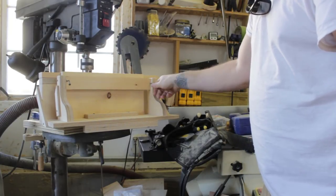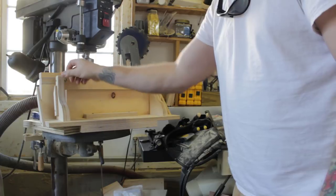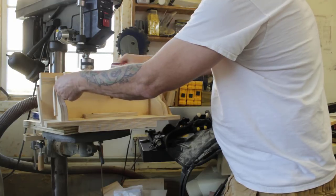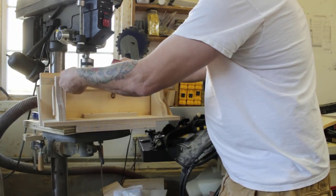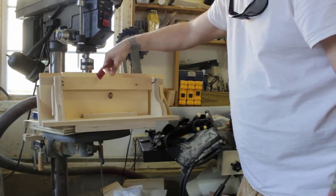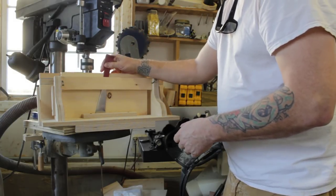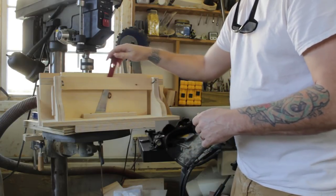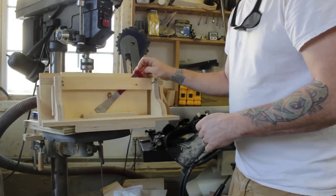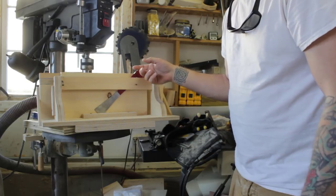Since this is eight-frame I'm going to use the screw spacers, and it holds it exactly where it needs to be. One modification I'm going to make is drill out a larger hole and use dowel pins instead of screws - but you can see with those screws screwed in now, it can't move. Then I use a hive tool just to make it nice and tight, holding it flush against the front of the template. There is some play for probably thicker wood, so you can use a paint scraper or a hive tool - and as a beekeeper I have hive tools laying everywhere.